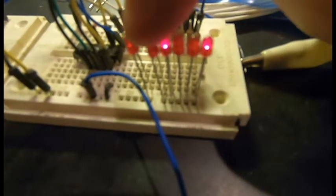That's the binary counter. Here are the outputs. I'd forgotten that on this model there isn't the first place. It actually skips from Q0 to Q3. So it actually skips two steps in there. So, and that's fine. Like, there's no reason I have to use the base one as the actual primary output of the clock. It could be this Q3 pin.